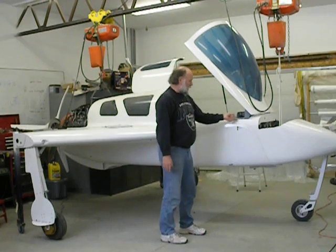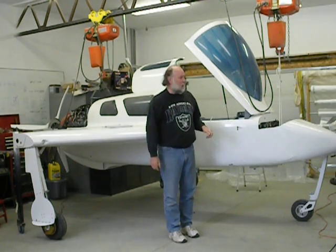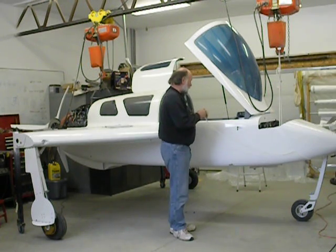To force it into a demonstration — to make it think it's actually flying at 90 knots — I'll have to blow on this tube. Watch the airspeed indicator take it above 90 knots; otherwise the main gear won't come up. So I'm going to do that and then raise the gear.